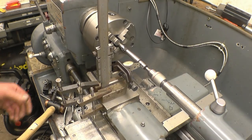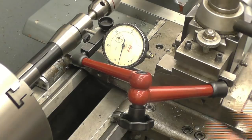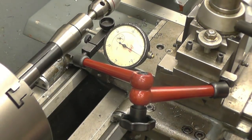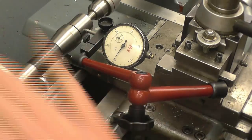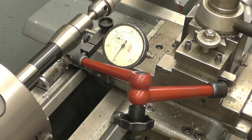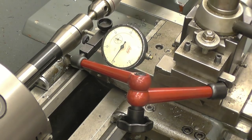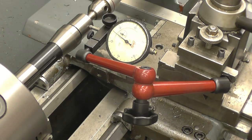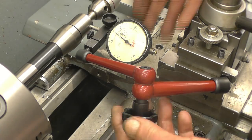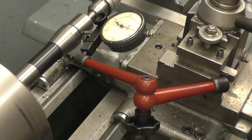Bang on. So that's come outside now - it's set at the same angle as that taper. I've got the orient arbor now set up between centers, running about what you'd expect from an import arbor - pretty good, a couple of tenths. Now if I wind the compound slide back, you'll see the clock gauge moves because that's now set at the taper I need to replicate. Hopefully now I can machine the taper on here and the chuck should fit - it may take a little bit of polishing to get it right, but it's going to be very near. This setup is working quite well - I need to modify one or two things but basically it's working where I'd expect.